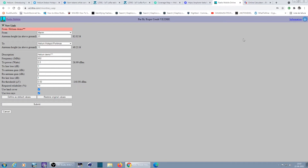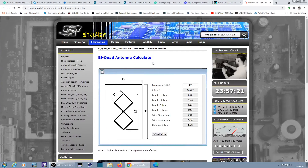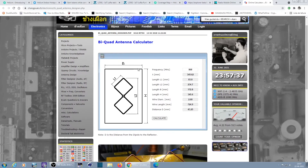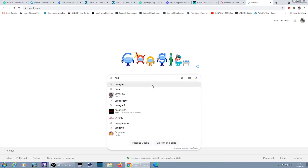We've been doing antennas for quite a while and know how to build them. A bi-quad antenna typically has a gain of about 8 dBi — it's simple, just two squares. A double bi-quad usually increases gain to about 12 dBi, but the drawback is it's a directional antenna — it only radiates one way. I'm explaining this for the crypto mining guys who might be watching.